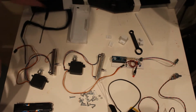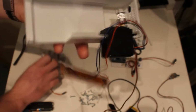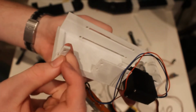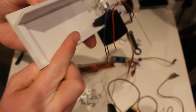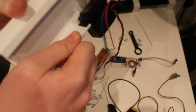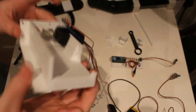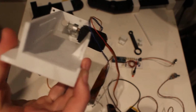Move that for a second. So the next thing I'm going to assemble is the actuator. One thing I'd like to point out is this corner support broke off. That's right here. That's due to a weak design with no support underneath it. As you can see, unlike this middle bit here, which has been designed so there's some horizontal support, because obviously it's a 3D printed piece, it builds in layers, so the lateral connections aren't as strong as the vertical connections, much like a tree.